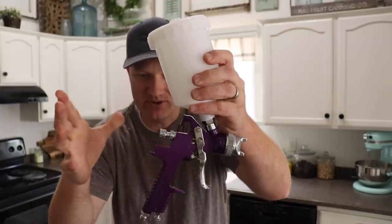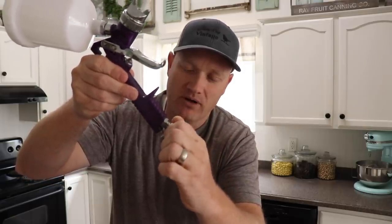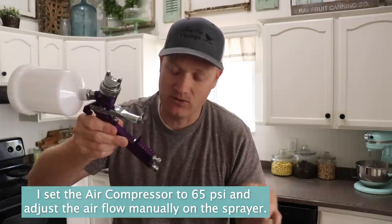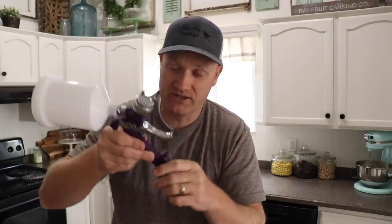It's spring loaded, so be careful when unscrewing it. The next thing is air regulation — this controls how much air goes through your gun. Some people like a separate regulator on the air line, and that works well. For chalk paints, I haven't found that's necessary since they're typically flat paint. Adjust your airflow until you get a nice good spray.